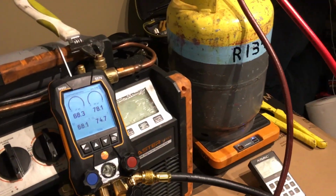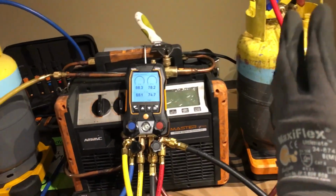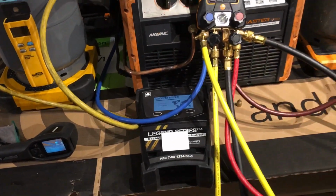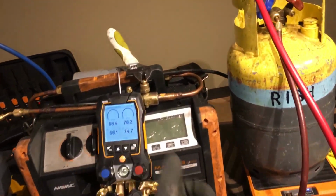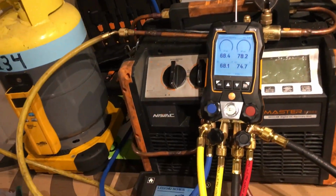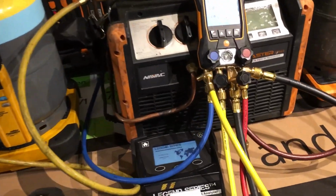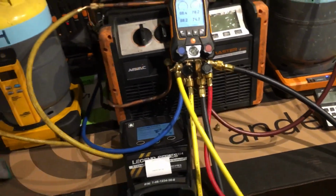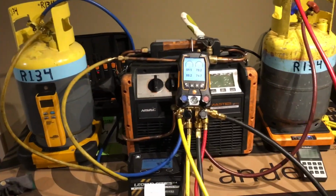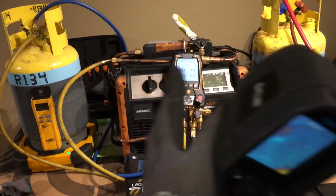It pulled out a few vehicles that had like 5%, 8%, 10%, 12% air, because these shops own these ridiculously big machines and they don't own refrigerant identifiers. They never service their machines. They don't change the seals in the end of their fittings, and it sucks in air. There's a whole bunch of excuses they give why they can't do it right, but we won't go into that right now. Just like guys in the HVAC industry make excuses why they accidentally or intentionally contaminate refrigerant because they don't mark their tanks, and they don't give their guys enough tanks.